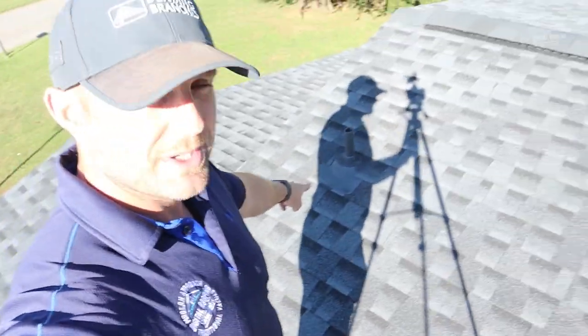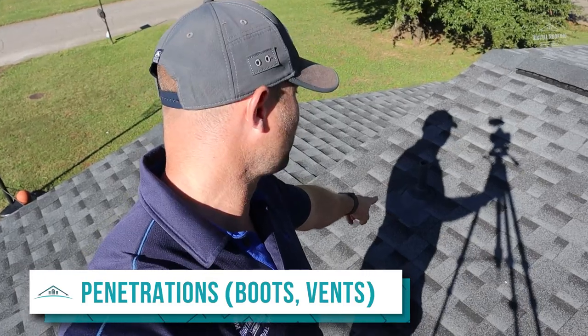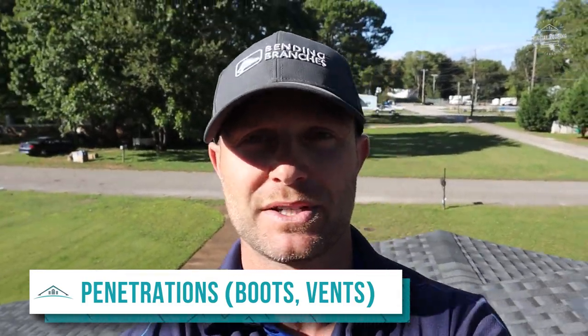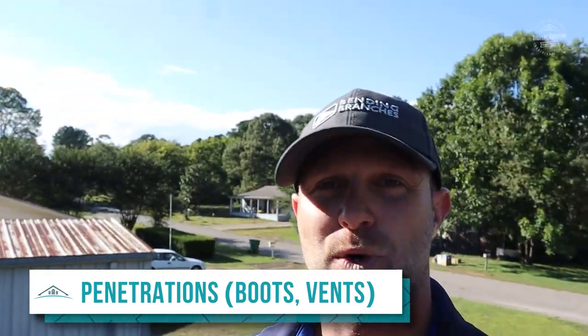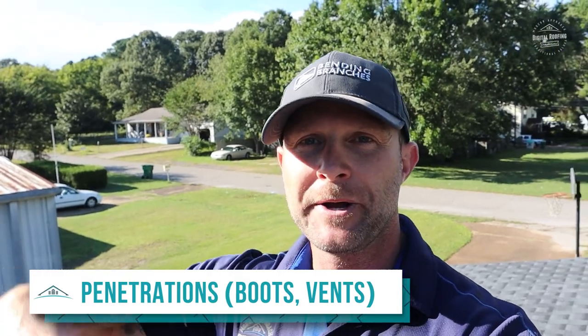Another spot that you always want to make sure you have ice and water shield installed is any penetrations on your roof. So we have a standard practice, even though it's not building code for most places around the United States, is we always target patch, is what we call it, ice and water shield. So all of our boots, vents, anything that we have that's a penetration on the roof, we go ahead and install ice and water shield.